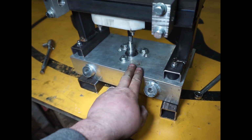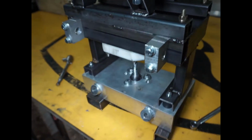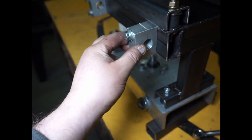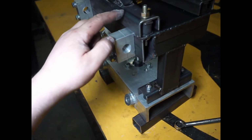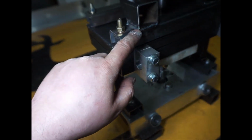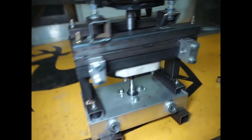Now also what I noticed is that where I put the handles, that still shakes quite a bit. However, up here it is really nice and smooth. So what I might actually do is rejig the handlebar clamps here, and move them up. Instead of attaching them to the middle piece, I'll attach them to the top piece. Not quite sure how to do that yet. I think I'm just going to put some sort of an angle bracket in here or weld it together or whatever, but I don't think that'll be a big issue. And then I can hold on to the very top, and the bottom can do its vibrating thing. So I think this is pretty good.